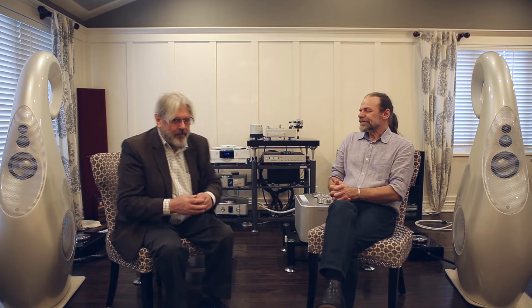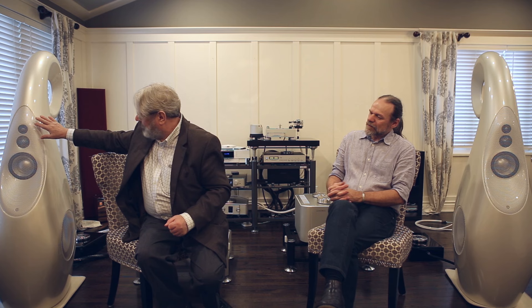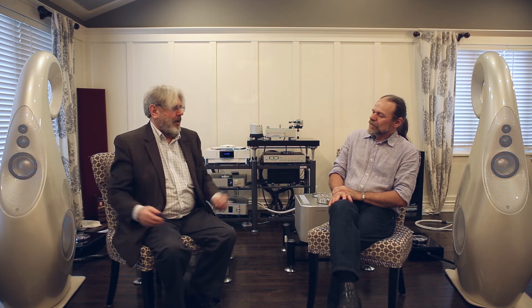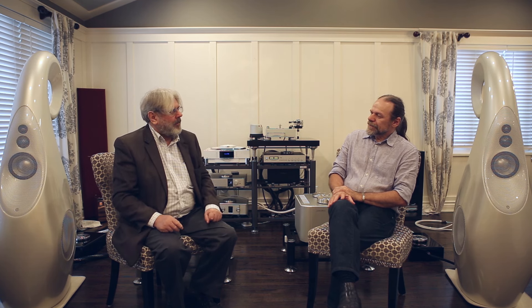The idea of a radially polarized magnet — where the magnet is actually a cylinder behind the voice coil — allows you to put frankly arbitrarily large amounts of magnetic material in, so you can achieve the best of both worlds. You can get the drive units close together. As you can see on the G1 Spirit, the tweeter and the upper mid-range dome are very close together, so you won't get the vertical dispersion problems you always get with loudspeakers that have widely spaced drive units.